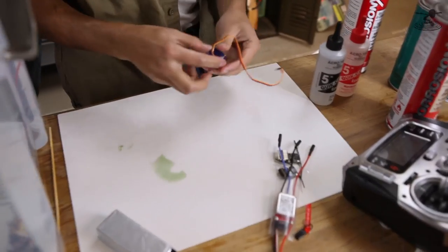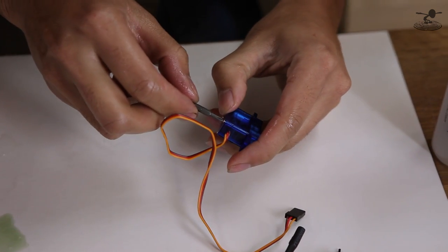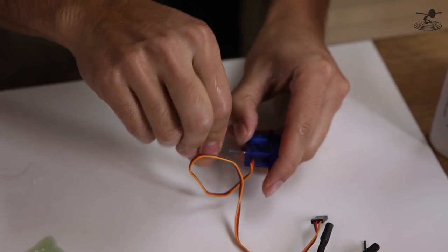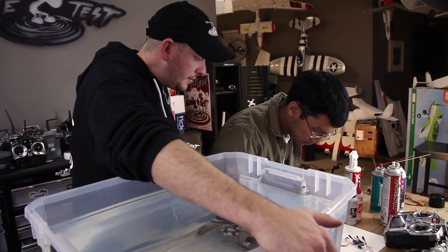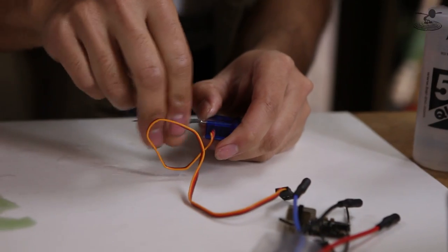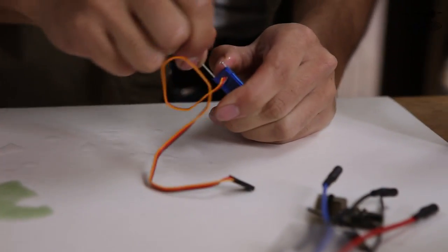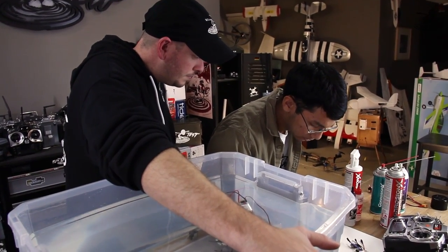So we go to the servo now? Let's go. The servo is the trickiest one of them all — you do have to decase it. We're going to take the normal screws off. This is a brand new TG9E, which is like two whole dollars. Now what main components are in a servo? You've got a potentiometer, the servo motor driver, and whatever the other component's called. You have to protect the potentiometer because if you get saltwater in there, it will give you false readings — a potentiometer is just a variable resistor, and water has resistance too. So the servo will just start freaking out — it's like the twitch of death.